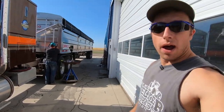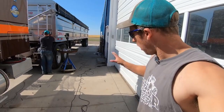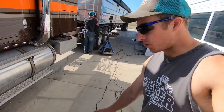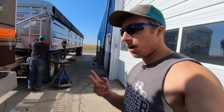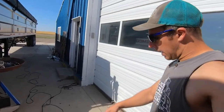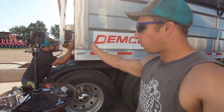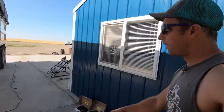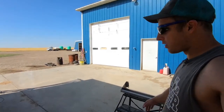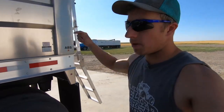While Leg Arms is finishing up the wiring to the tarp opener and gate openers, I'm going to go ahead and start on the AgCam. Got it all unboxed. I laid the monitor out — this is roughly where it's going to be on the truck. For now we're going to do two cams. I've got the cable spread out — they've got a long and a short. The short is going on the truck end so all the connectors will end up right where the trailer connects. The long one runs all the way back to the back hopper, so this cam will go in the back facing towards the hopper inside so you can see the rear hopper for the operator.